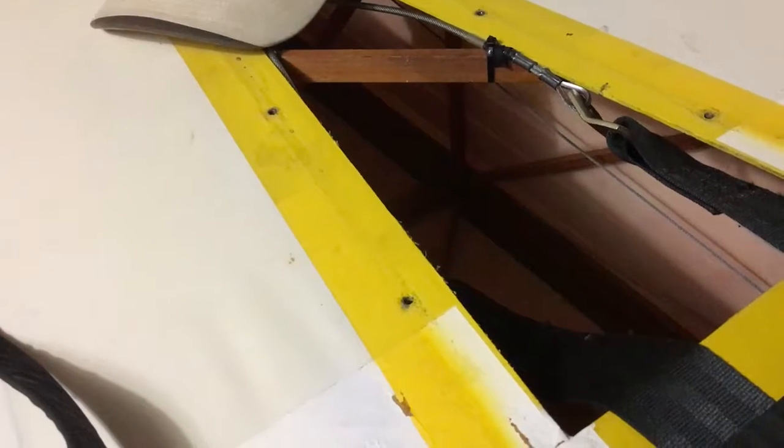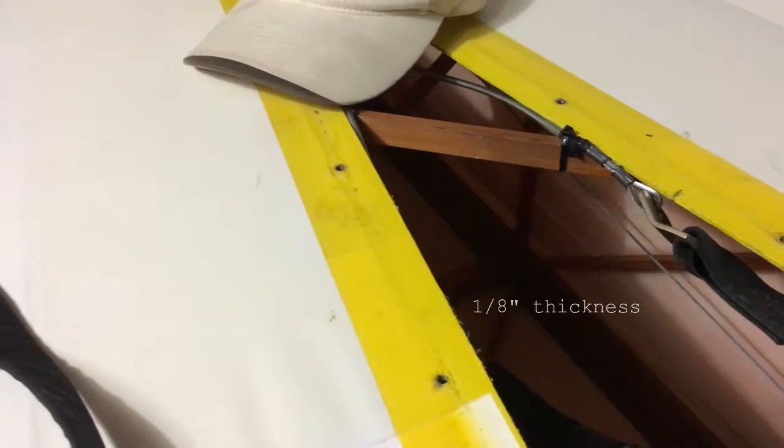If you'll notice inside that space in the bottom, which is kind of dim, there's space in the bottom side of the fuselage that I'm going to cut out. I've installed a longeron spacer between the longeron and the fabric. I put a piece of 2-inch flat spruce and glued it in place to the fabric and to the longeron, so it would take up that gap. So when I cut it out, I won't lose any tension on the fabric.